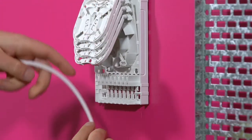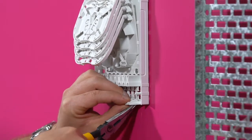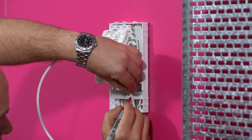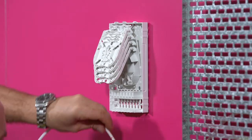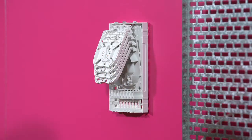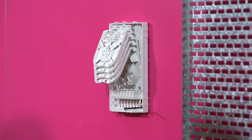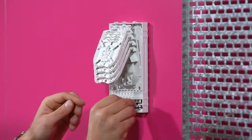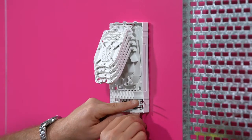Choose the position you want to enter the box and remove the bottom tab with pliers. Place the drop tube into the slot and mark where the tube should be cut — this should be above the cable tie area. Cut the tube at the marked line. Apply two cable ties in the drop tube position, placed over the internal tabs. Push the drop tube into position and cable tie.